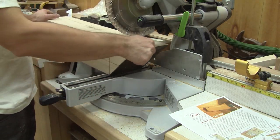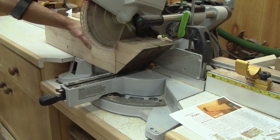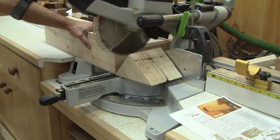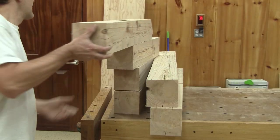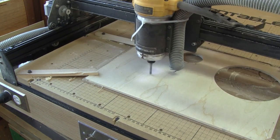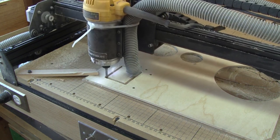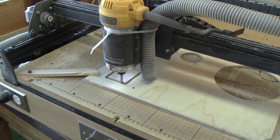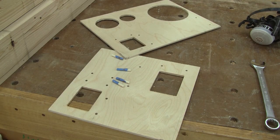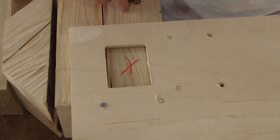I need to cut all my six-by-sixes into pieces. Next, I use my X-carve to cut a mortise pattern onto thin pieces of plywood. When I have all my patterns, I can insert some guide dowels and trace the shape of the mortise.